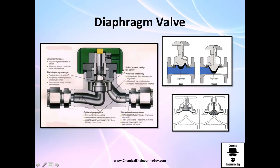The diaphragm valve is kind of similar, but instead of just a plug it has a diaphragm. When the diaphragm is pressed down you have a perfect hermetic closing — no flow goes from left to right. When the diaphragm is up, you can have flow. You can see how the diaphragm changes direction, literally like the diaphragm of a person: it inhales and opens, it exhales and closes.